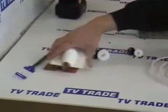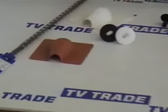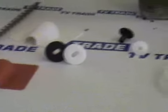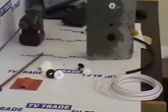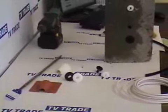This is to cover an area in case the cement is cracked around the base of where a hole has been drilled through a wall. In the case of running a single cable through, we use a 10mm drill bit. It has to be 450mm long to be able to get through a standard cavity wall in an Irish house. Anything less than that won't be long enough.